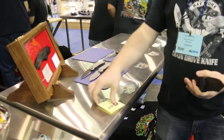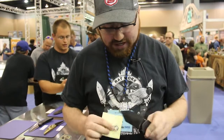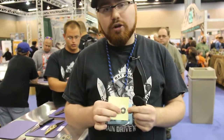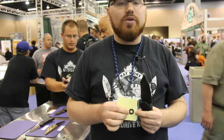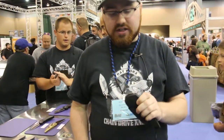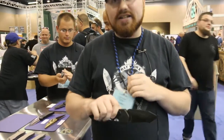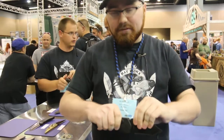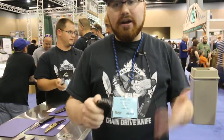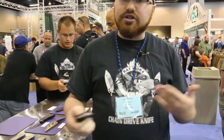Our ball bearings — we use self-lubricating ball bearings. It's a ceramic ball bearing, which you can see here; it's the same size that's in the knife. The housing is impregnated with molybdenum disulfide. Every time the knife opens and closes, it lubricates itself, but the housing itself doesn't shrink down, so you aren't going to gain any play in your knife system. It'll keep getting smoother and smoother because it continues to leach out that lubricant. So you don't have to worry about taking your knife apart to oil it or lubricate it — it does all that for you.